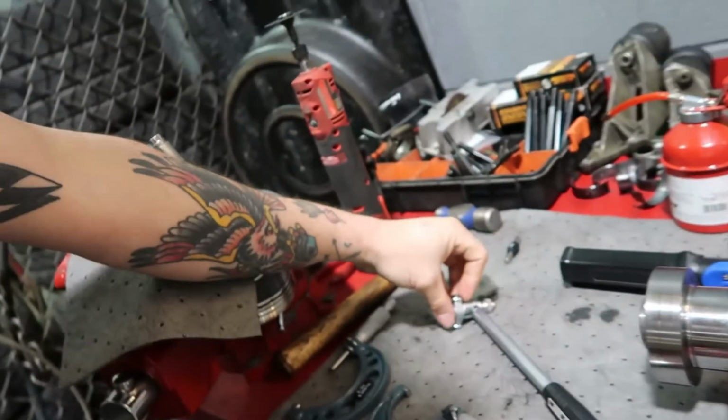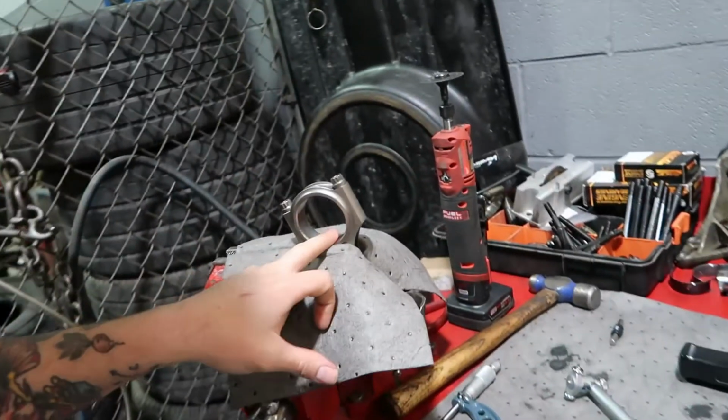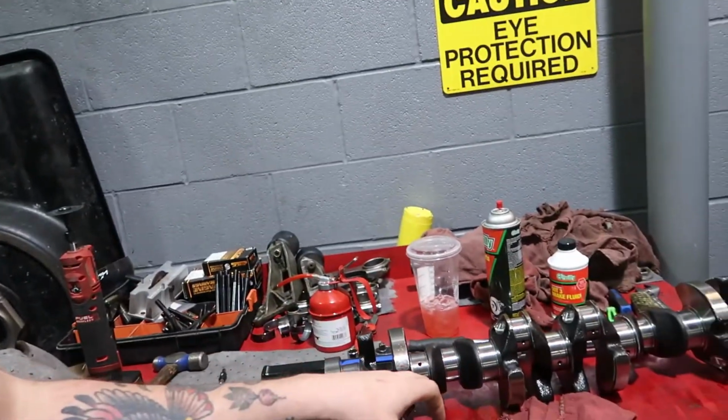And yeah, I know I may make it sound easier than it really is, but it's only because it is extremely hard to describe on camera. I've tried this twice now, and it's just kind of hard. Your main takeaways are, you're trying to measure this to get, and then that, and then compare the two, figure out how thick your bearing is on whatever parts website or whatever bearing you get, find what oil clearance you want, see if you're within spec.